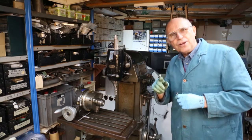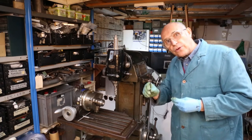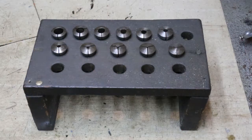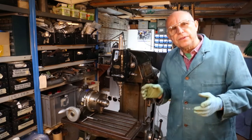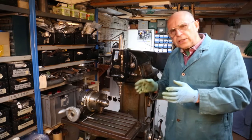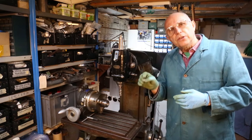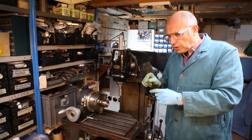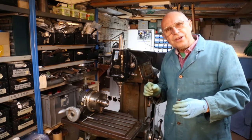You may say all you have to do is put in the appropriate collet and then put your drill into the collet — and that would be true. Unfortunately this is my range of collets, and as you can see it's not extensive. All the collets are imperial; there are no metric collets at all. When you're drilling you use a whole myriad of different sizes, and the chances of getting a set of collets to cover all of those is pretty remote. However, there is a simple way of making a collet to fit inside another collet to take the drill, and that's what I'm going to show you how to make today.